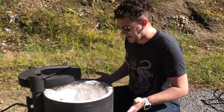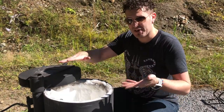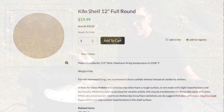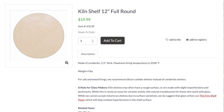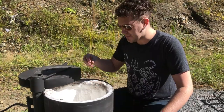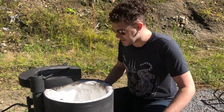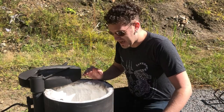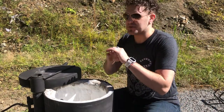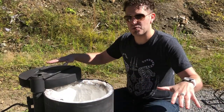Because this was a round tank, I got a round kiln shelf, which is like a ceramic board — it's for potters, usually what they put their pottery on when it goes into the kiln. I have one of those on the bottom as a hard bottom, so as that deteriorates I can just replace it, which is quite nice. They do make ones of high silicon carbide that are almost indestructible, and you can put those on the bottom for a nice flat surface to work on.